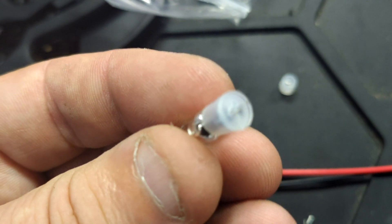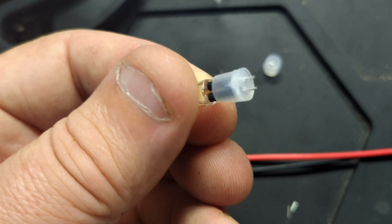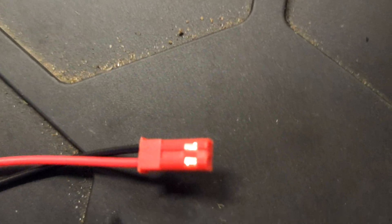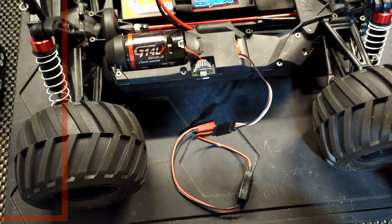You need a 1 volt infrared LED. If you look at the LEDs, you've got a tiny flat spot against one of the legs — that's going to be the negative. We used a few bits of heat shrink in the bottom of the holder just to push the LED forward in the actual holder bracket itself, so it's got a clear view of the lap monitor.